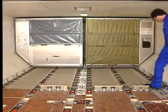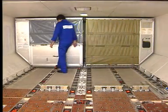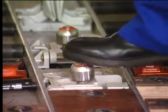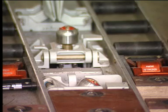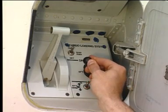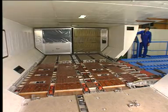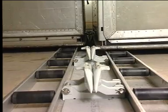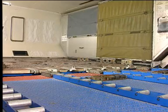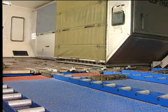Once the ball mat is clear of the containers, the overridable XY guide has to be lowered before unloading the remaining positions. Manually unlock the next container to be unloaded. Select aft with the joystick. The longitudinal movement starts.